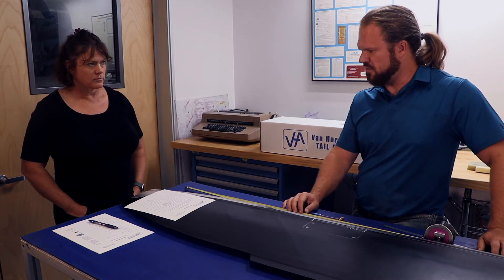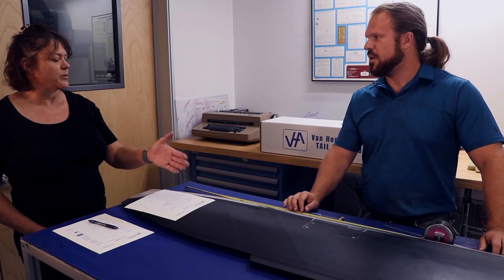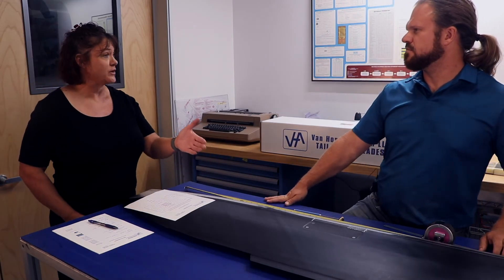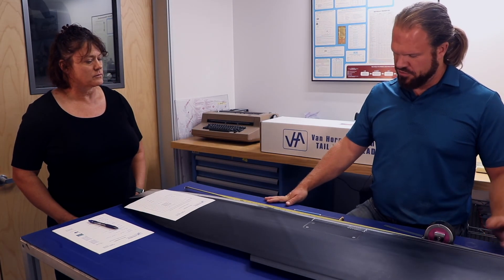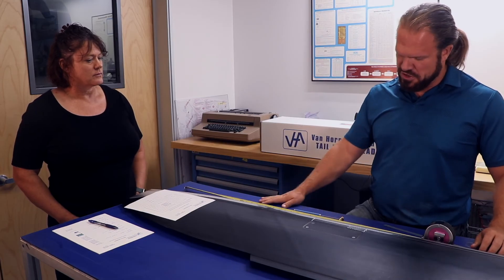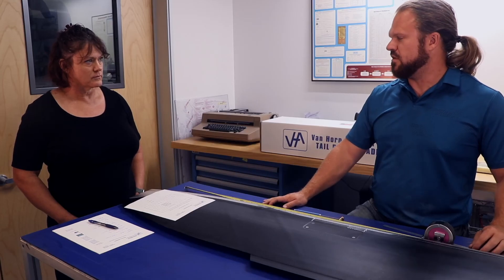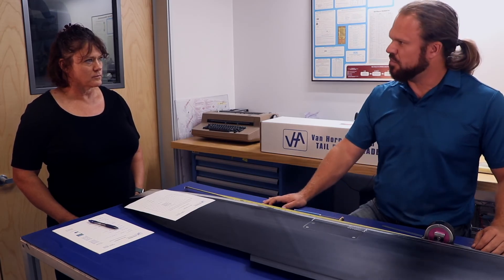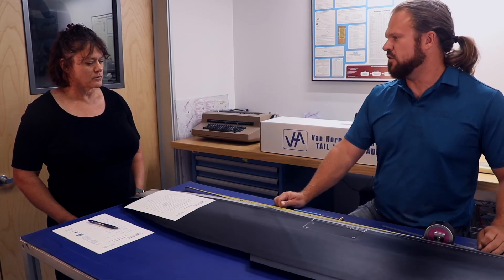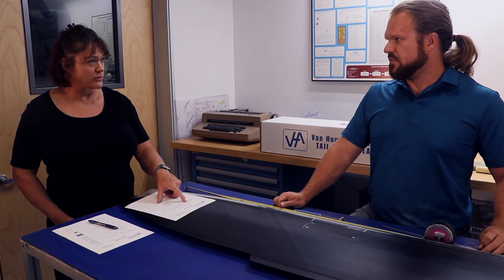It was pretty clear hearing the sound of that tap just now, but what should an operator do if they're not sure whether they're hearing a delamination or not? What some operators have done — and it works really well — is just take a video with your camera phone or whatever you have available of you doing the tap test exactly like we showed here, and send it in to us and let us give it a listen. Usually it's really easy to hear where it changed, and we can help show you where that's occurring and what to listen for. And again, for the service bulletin, this tap test needs to be performed every 400 hours. Correct.